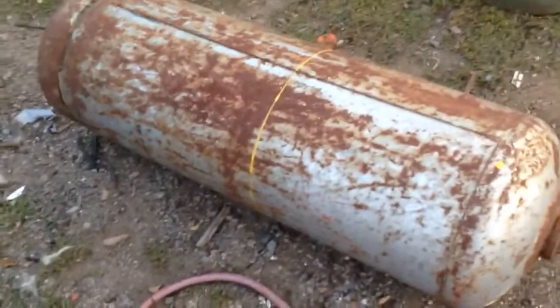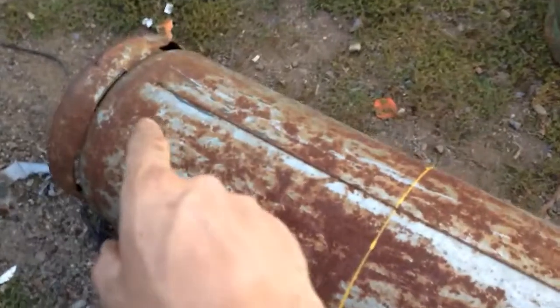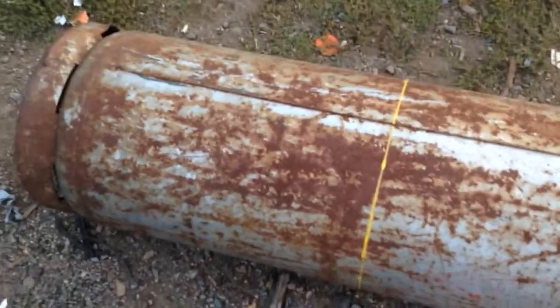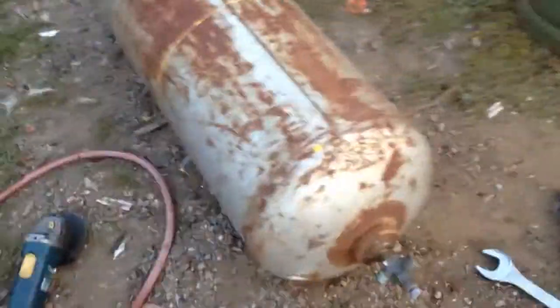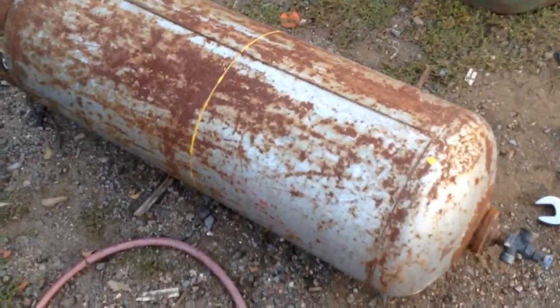It's hard to make a straight line on a curved surface like this. There's a weld here all the way around, so I measured from the weld and I made a dot, and I did that all the way around the tank. Then I just played connect the dots with this flexible piece here — it has nice straight lines on it. I just laid it across, curved it, and drew a line along the edge. That should get me pretty close to a straight edge, or get me started anyway.